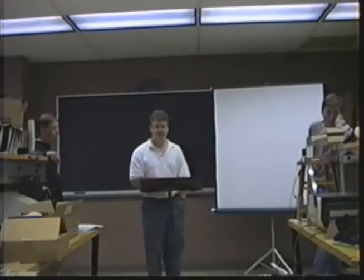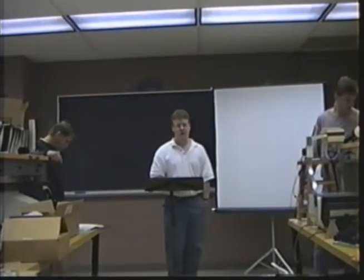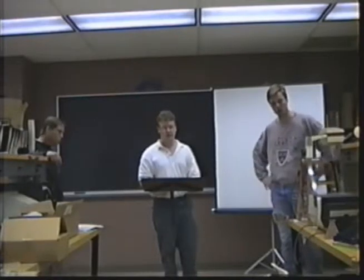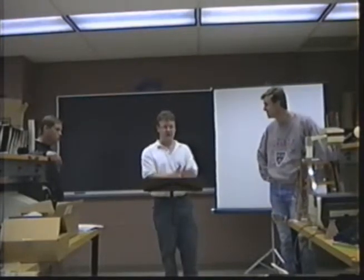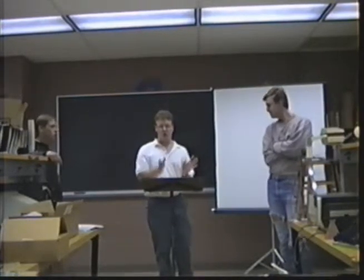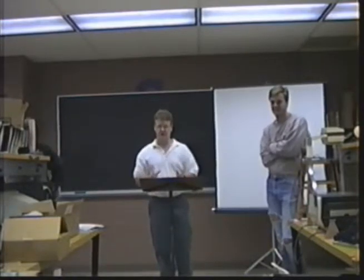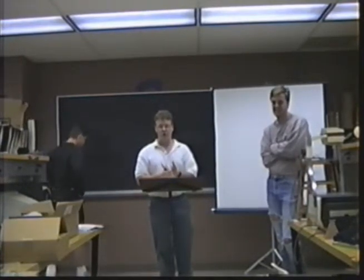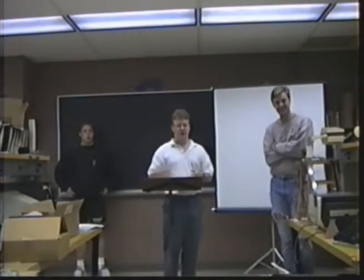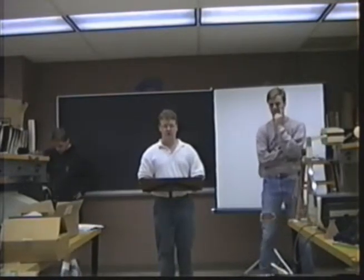Going back to Vince's question, it's not large, and in order for you to be able to gain a direction, you're going to need three tone decoders, so that when you have the input to your microcontroller, you can tell which one it is, and so that you have different directions, not just one. If you wanted to only have a front direction, then you only need one. But it's not a difficult or a large circuit to reproduce.